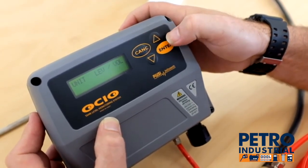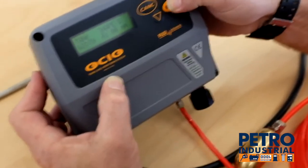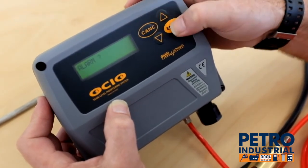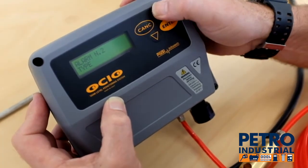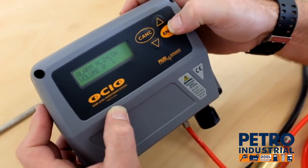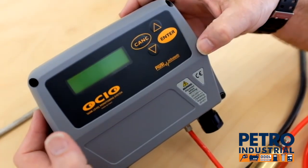The unit goes back to the beginning and we're displaying in millimetres. This goes around in a loop if you keep pressing. So you can see it going around the loop — tank shape, calibration, unit, alarms, number one alarm, number two alarm. I can change it between low and high volume. I can change the low alarm to 95 or zero. These up and down arrows navigate, and cancel takes you back. Now we're back out into general operation mode.